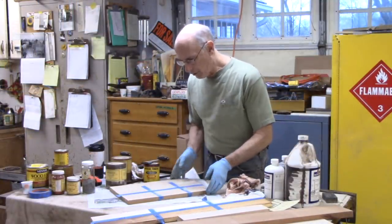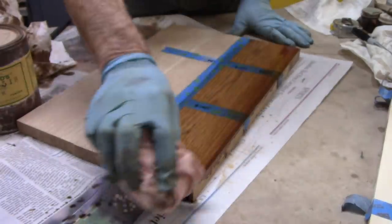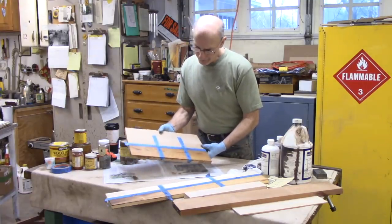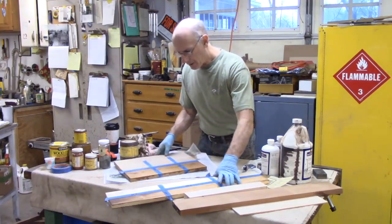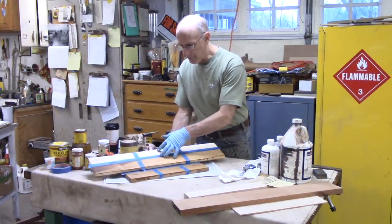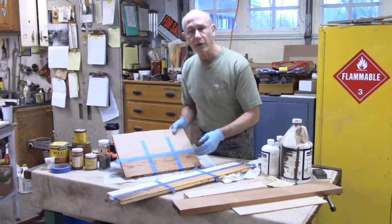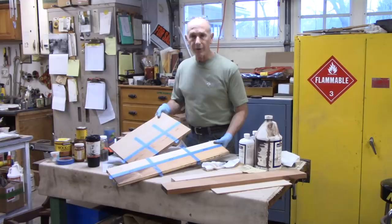Now I'm going to try the same thing on my oak board. Oak is not nearly as soft as the pine, and this is white oak. On the oak sample there's very little difference — maybe no difference — which really brings up a couple of points: how drastically different wood types respond to the same stain, and how they were sanded. The pine being softwood was much more dependent on the scratches. The oak's big open grain held the pigmented stain, and they all look more or less the same.